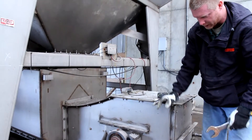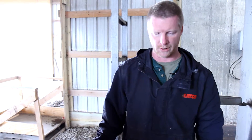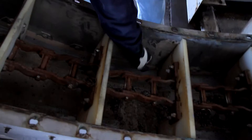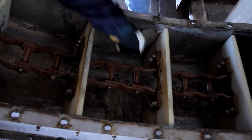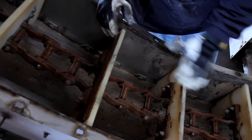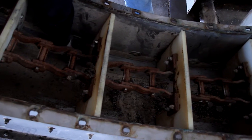Once we have that done, we go back up to the front and check to see if we have any clearance on our paddles. Now we're back over here at our incline, and if you notice, we've got clearance underneath our paddles, which means our tension is where it needs to be. You don't want clearance on all of them — as long as you've got the first couple in that main transition, that's what you're after.